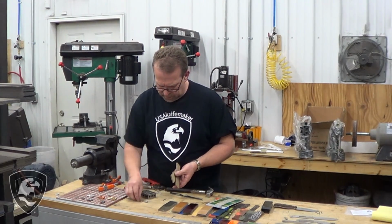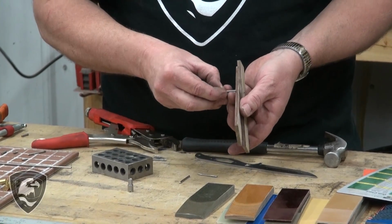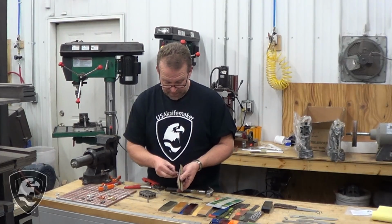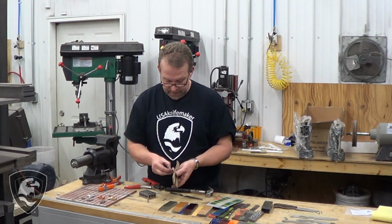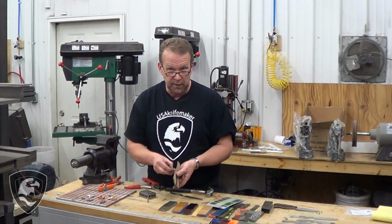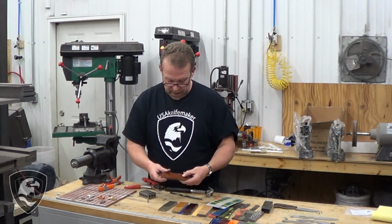We're going to take a drill bit that's appropriate for the larger diameter on these Corbies, and we're going to drill it down about halfway. We're not going to get fancy with any measurement or anything like that. We're just going to drill it down halfway and call it good. Then we'll sand off the excess. So let's go countersink these.